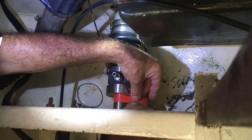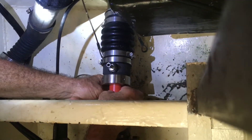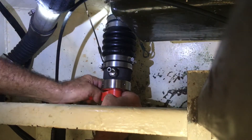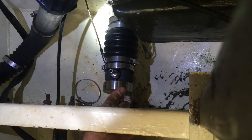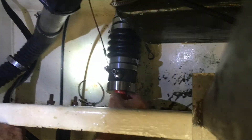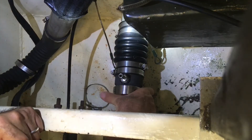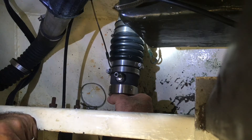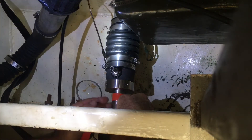In case you're wondering what I'm doing here, I'm just following the manufacturer's guidelines on the installation of this dry shaft seal. What they recommend is that once the stainless steel stator is pressed up against the carbon ring, we then place a piece of tape here — this is going to be our marker point — and then we compress the bellows. For this size shaft, they recommend you compress it by 20mm. Easier said than done, I think.